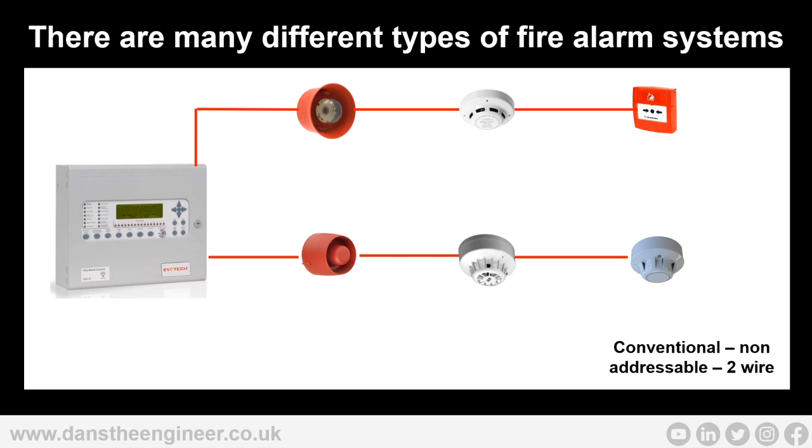If you're putting sounders on the zones you're increasing the alarm load, so you've got to think about that and make sure you don't overload the circuits. Every manufacturer is different — you need to understand what can be put on each panel. There's a lot of best practice. The question remains: can we stand in front of that judge? We need to do our calculations when doing the design. If somebody else has designed it, fantastic — you can install as per that design. But if we are designing, we need to think about all of this.